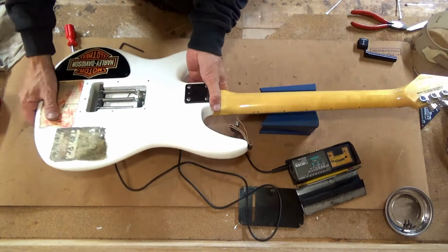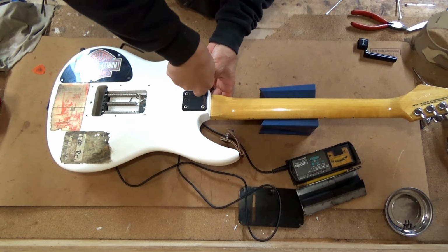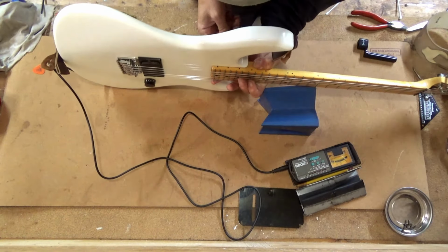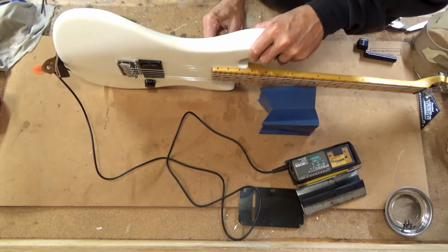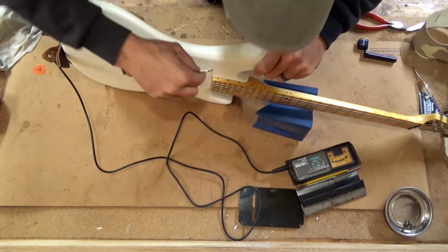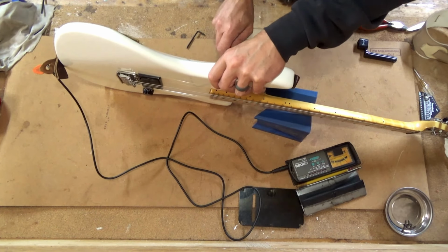So how you do that is we're going to loosen off a couple of these down here. Just a hair. And we take an Allen wrench, and I'm going to screw it in until it kind of looks about where I want it. Alright, now I just brought it up. Putting all that dirt up with it. Just a hair more right there. I think I like it. And we'll lock it down.